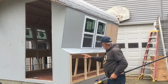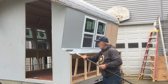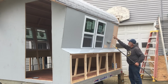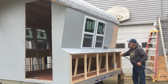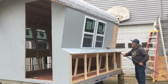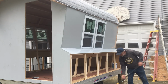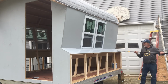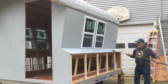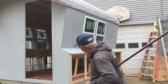I still have to sheathe all of these openings so that then I can build the doors to go outside of that. These, I don't know if you can see that from over there, where the 2 sheets came together. There's going to be battens wherever they can go. They'll be about 2 feet apart so that they'll catch a stud on the inside. Side 2, that was about 3 minutes. That didn't take long at all. We'll go around to the other side and paint that, prime it.